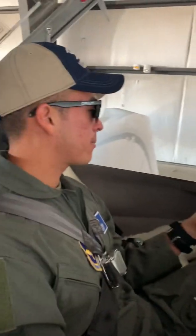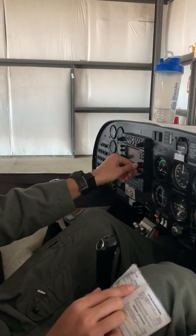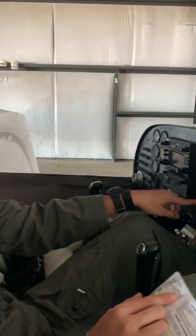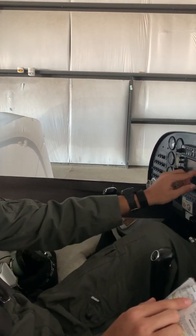For avionics and nav equipment: if there's a radial we need to input, we come in and go three clicks over, select Pueblo VOR, hit direct, enter, enter. Then hit OBS and come to our course deflection indicator, set the appropriate radial for that, and hit enter.